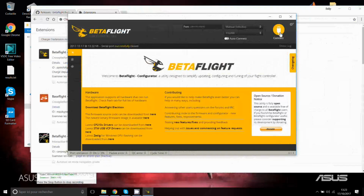So to resume, don't change any settings in Betaflight. You will block your machine, and you will need to do this trick with Betaflight Configurator 3.1.1 to reset the factory settings from this current version. It's definitively confirmed that you cannot apply any dump or version settings, whatever the Betaflight Configurator versions.